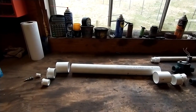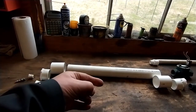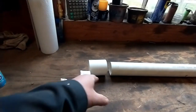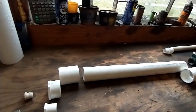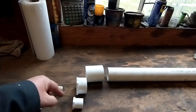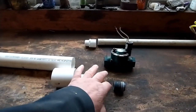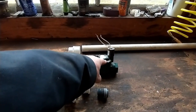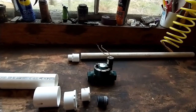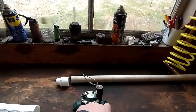Like any air cannon, there's a pressure chamber where the air collects before it gets blown out through the barrel. On one end you need connections to get from a regular airline up to the two-inch PVC air chamber — you just find the right fittings at your hardware store. At the other end of the chamber you need something controlling the flow, and I'm using a regular irrigation valve that I recovered from an irrigation system I took apart.